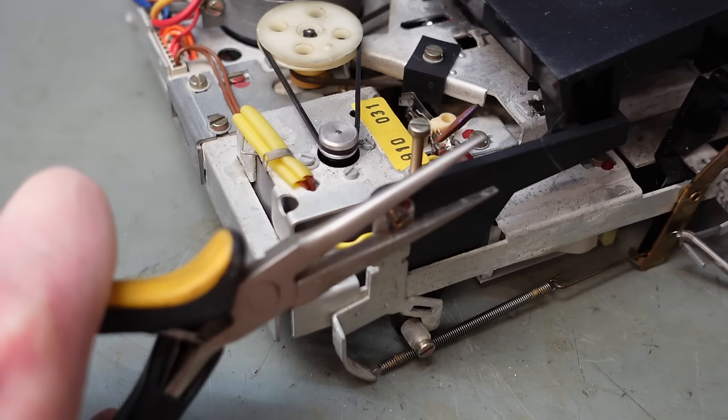I spoke too soon. Let's try a bit more of a heavy duty bit of tool in here so I can keep a grip of it. Yes, that's off. If I can get this arm off here, there we go. Slacken that off as much as I can. See if I can do the same again. This one might be easier because it's not got into the threads as much. So if I deal with this circlip, hopefully just leave it off. Yes. That's one out. Same with this one.